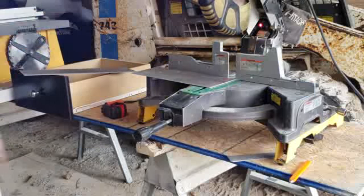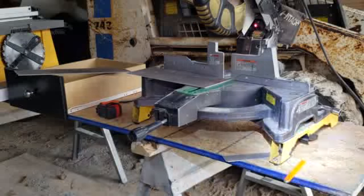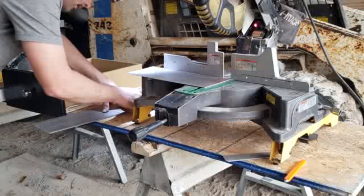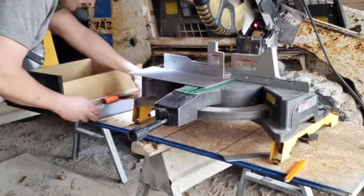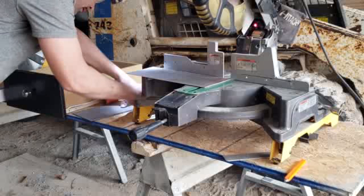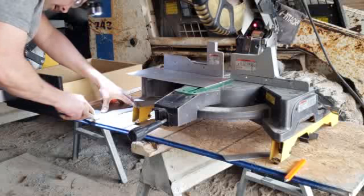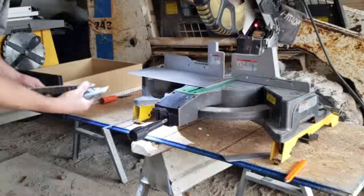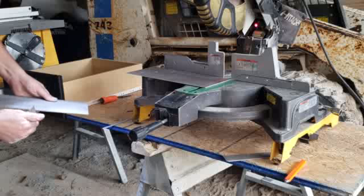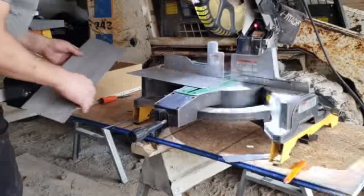What I've got to do is take this lip off, because if this is visible you'll be able to see it. So the best way to do that — get a brand new utility blade and your utility knife. Lay this down and cut just on that edge, just taking that little bit out. Try to just take that lip off. If you miss some, come back and touch it up. Then you can build a sandwich and piece it across there.